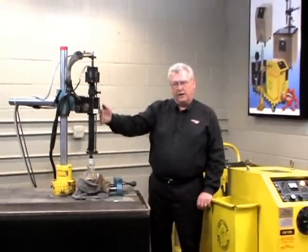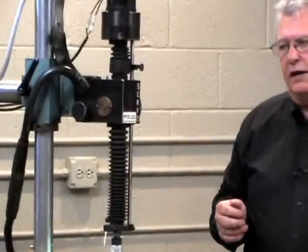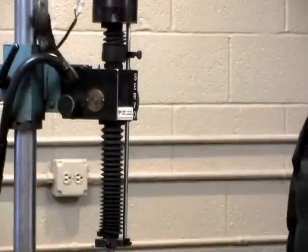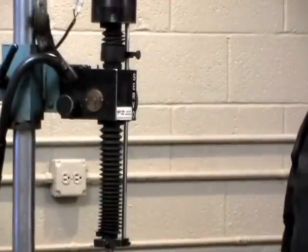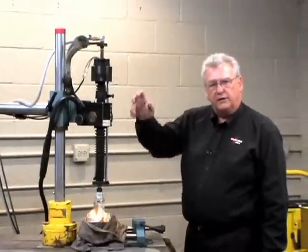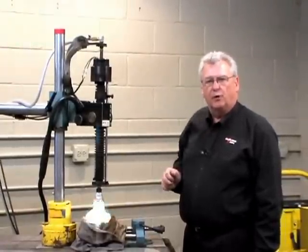The disintegrating head has 12 inches of feed, automatic depth stop, and an automatic servo feed controller. As the head is feeding down, the servo controller will make the adjustments for optimum performance.